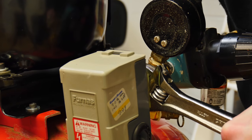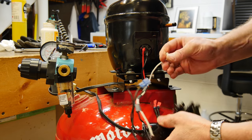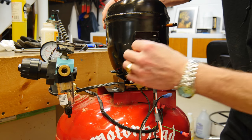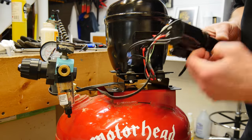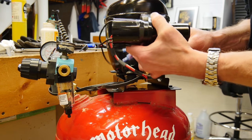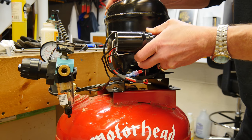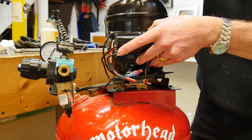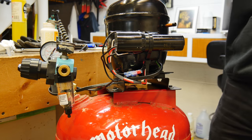This is the pressure on/off shutoff valve — this is what turns the compressor on and off to fill the tank. That mechanical switch literally allows current to flow to the capacitor, which is what I have in my hand. The original capacitor lasted about a month, so this is an aftermarket unit — a much bigger capacitor that allows the compressor to turn on and off without any issues. I haven't had any problems with it. It's rather unsightly, but it works flawlessly.